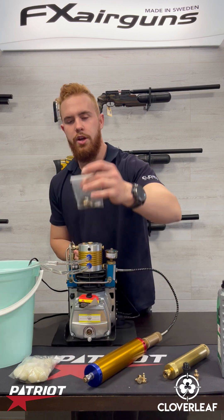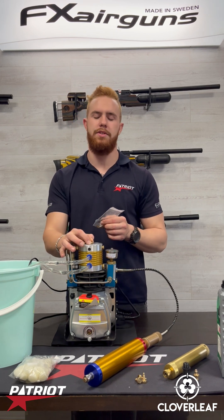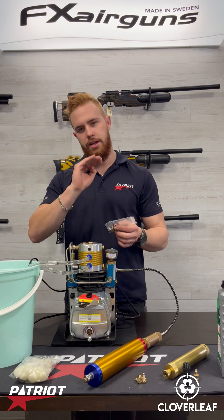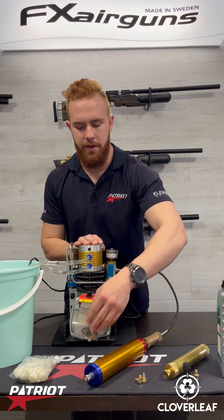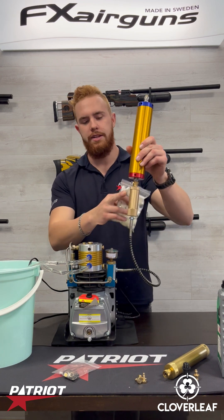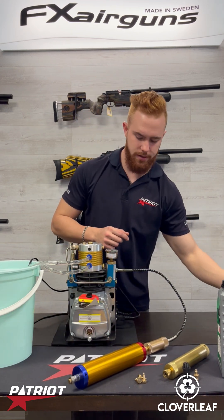In that box you'll get your bleeding nipples, a safety pack — or o-ring pack or service kit pack as we call it — and burst discs, which are for safety on this compressor. It's a little brass disc, and once you turn it out it's a little plate. Before the compressor wants to go, one of these plates will go instead, so your compressor is very safe to use. There's also a filter bag — with this filter comes the filter itself, plus something bigger on the front I'll run you through later.